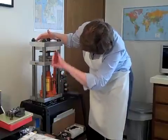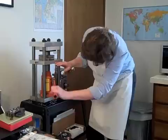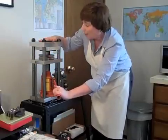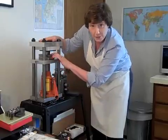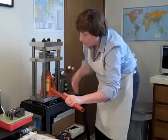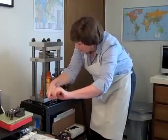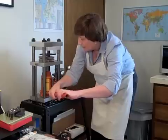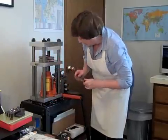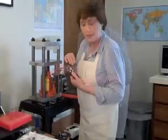As you can see, with each pump of the handle it raises the platen, and I'm coming in and pushing — and there, you hear that little pop. That indicates that the die has cut through the sheet of metal. I can feel that it's already gone as far as it's going to go, so I don't need to push any farther. You want to be very gentle with it. Lefty loosey, down comes the platen, close it back up, set the handle aside, take the steel plate, set it aside, and pull out the circle cutter — and there's my disc.